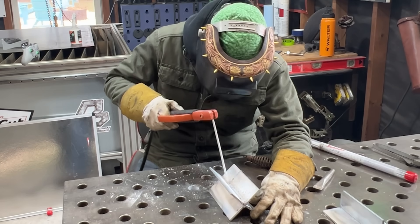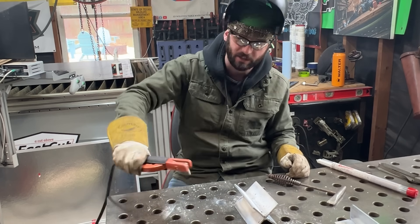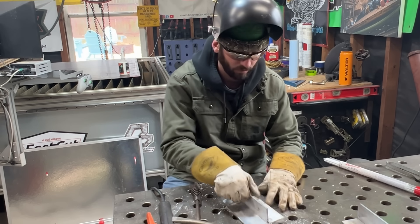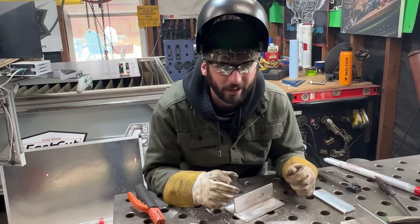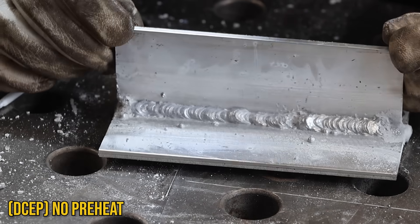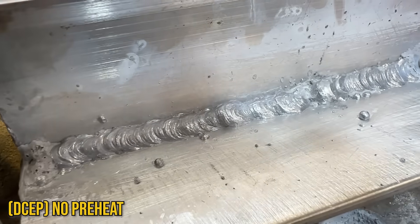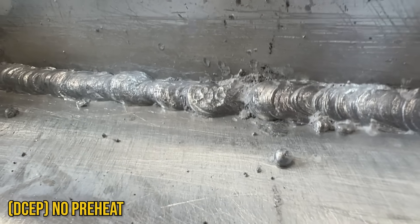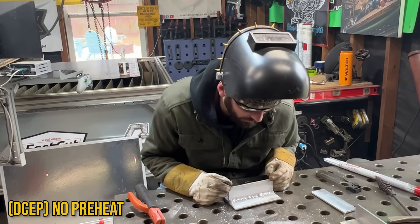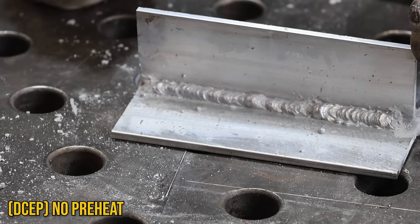The center is definitely warm now. Just doing some circles, some motion — the plate seems warmer, and that definitely makes things smoother. We didn't have any of that smoothness at the beginning of this weld. One other thing I don't really like about aluminum stick welding: it looks terrible. At least I've never been able to make it look pretty. Everything happens so quick. You can see our restart is pretty high. The weld's on there, it's mostly the same size. Again, we didn't have any preheat — we had a little more heat towards the end since we'd already put a weld on and had to make a restart.